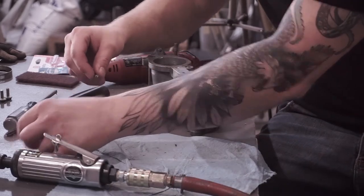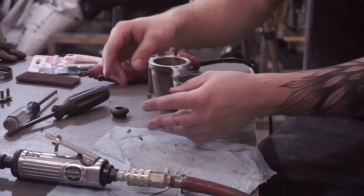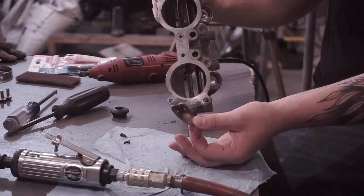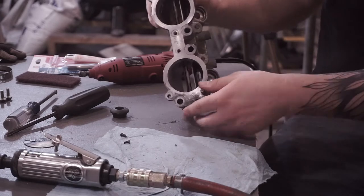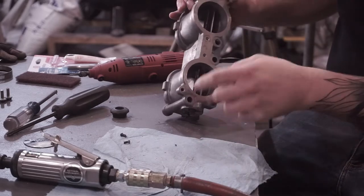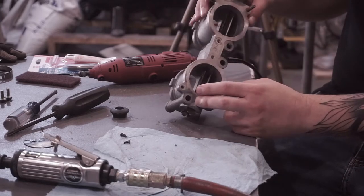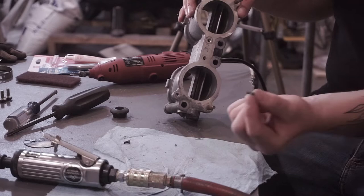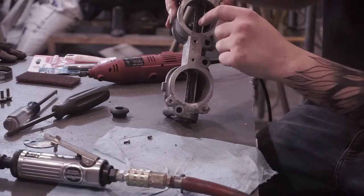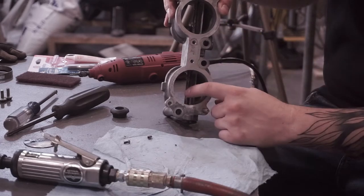After removing these small screws — which, like we talked about earlier, you have to grind down the tips of them — you're then able to just slide out your butterflies. They come out really easily. Next step is hammering out the shaft. Make sure first that you don't have any burrs sticking out that are going to make it harder for the shaft to come out. Since these lower pieces are staked in, there's potential for leftover debris, so clean that up along with any grindings.